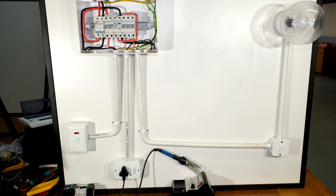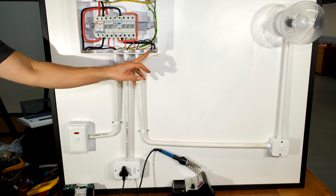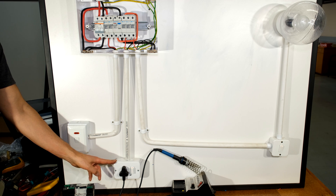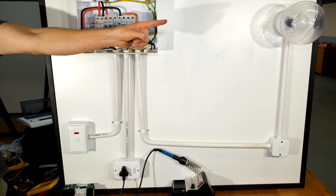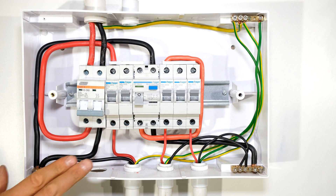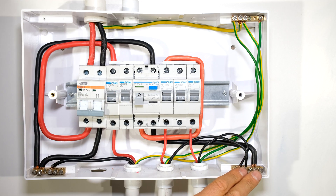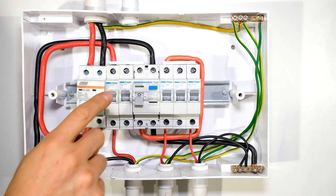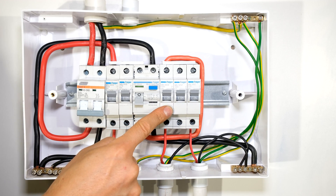In this video I'm going to demonstrate how to wire a DIN rail DB board with two neutral rails. I have a stove isolator, a plug outlet with a plug circuit, and a lamp circuit on the far right with a light switch. On one side the stove circuit is protected by overload protection and backup protection. On the other side earth leakage protection covers the loads, backed up by additional overload protection.